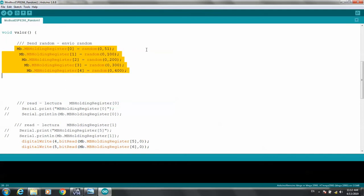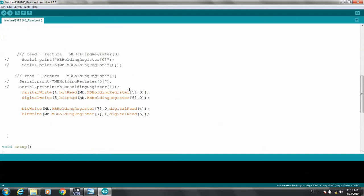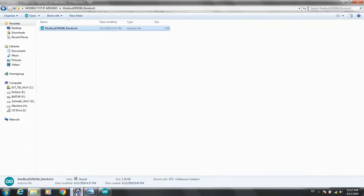You know that the holding register is 400001. Okay, that is this, 400004. That's the holding register address. Okay, let's see the TIA Portal.